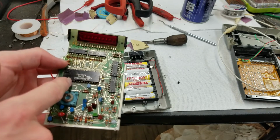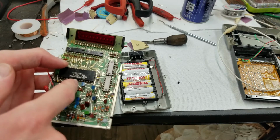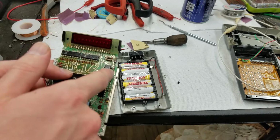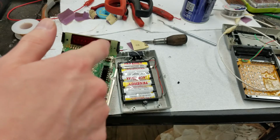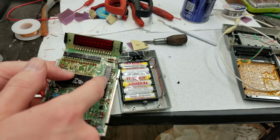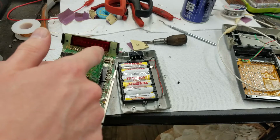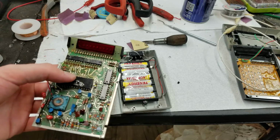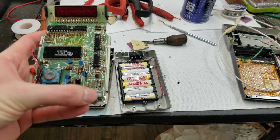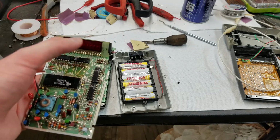So the segment pins come out this side. It will send, I think, 5 segments. So 5 of the segment pins will go high, which will put driving voltage out of 5 outputs on these, which go up to those 5 segments to light them up. So it's double action. You've got the segment drive connecting the segments to positive. At the same time, the digit drive is connecting the common cathode digit to negative, and so the current can flow through. Now these chips get their driving voltage through this transistor. So if this transistor turns off, these chips have nothing to provide to the display, so the display goes out.